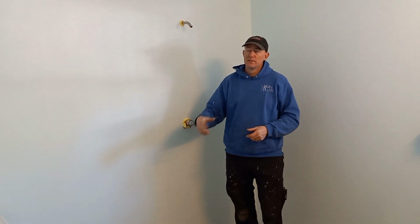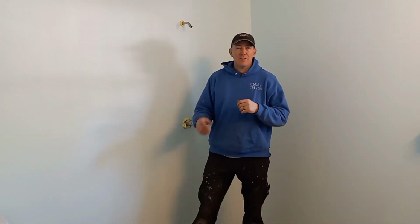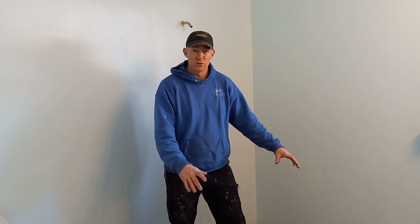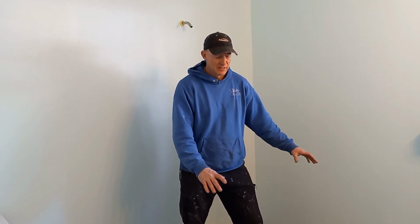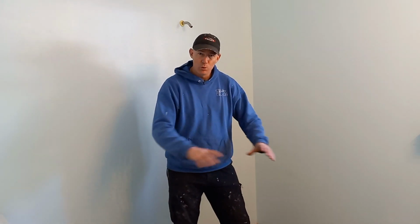6 inches wide, we'll get into that later when I start building the walls. It'll all come together. So first things first, we've got to make forms for this curb. We're going to pour fresh concrete on top of 2-year-old concrete. So we've got to prep the concrete, make sure it sticks really, really well. We don't want that curb to move. So we're going to build some forms, prep the concrete, and pour a curb.